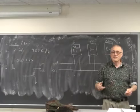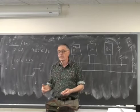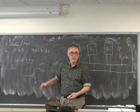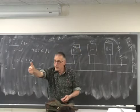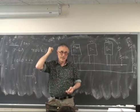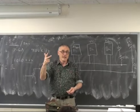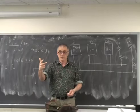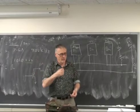So there has to be a way of signaling data. Oh yes, and because this is an address system, every device has an address, so there has to be a scheme for sending data over the bus, separately sending addresses over the bus, and separately sending the it's-mine, it's-not-mine signals over the bus, which are referred to as start and stop in I2C, or TWI.